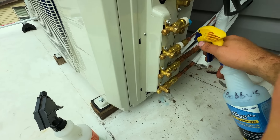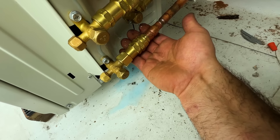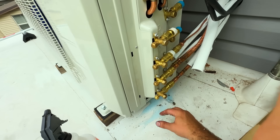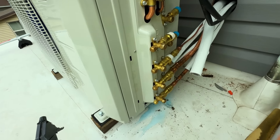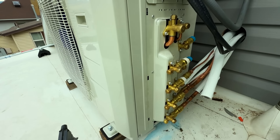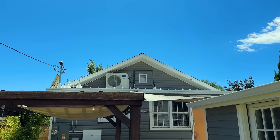Our system is running and pulling tons of heat — all the suction lines are super cold. We're spraying connections down with micro gas leak detector solution; the instructions say to spray as soon as you make connections and after startup. I'm not seeing any bubbles anywhere. Everything inside needs to be wrapped completely with no exposed metal in the attic — a leak in the attic is definitely a big deal and you don't want to flood your house.